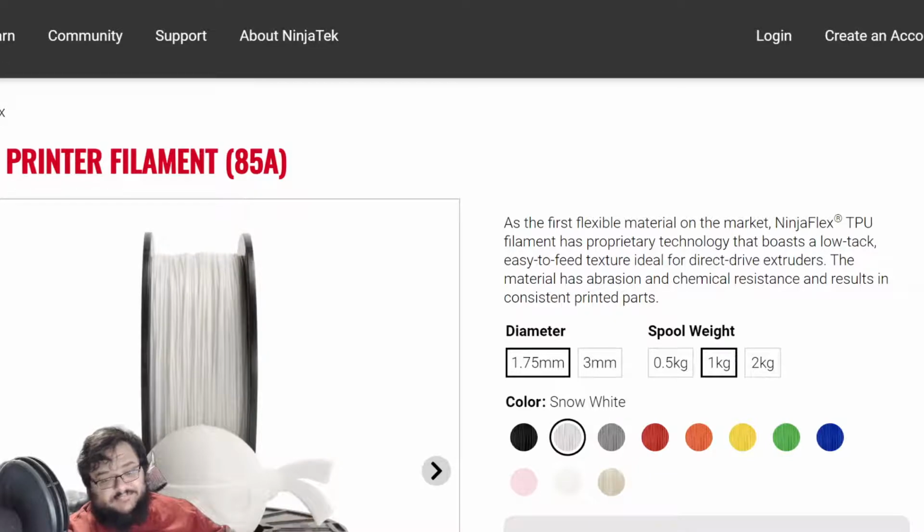And because of that, Shore 20A is just way too flexible for what I'm trying to do. So I was thinking about trying to get some Ninjaflex and printing my 3D mold out of this stuff. The only problem is there would absolutely be layer lines in the resin cast that I would make from the mold. You can't really vapor smooth this stuff like you could ABS.